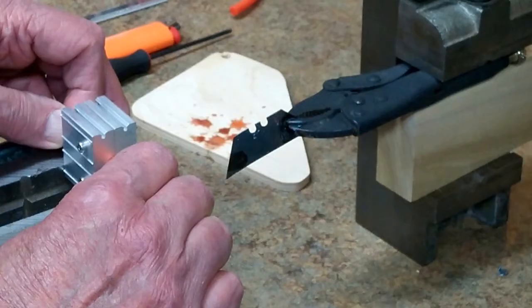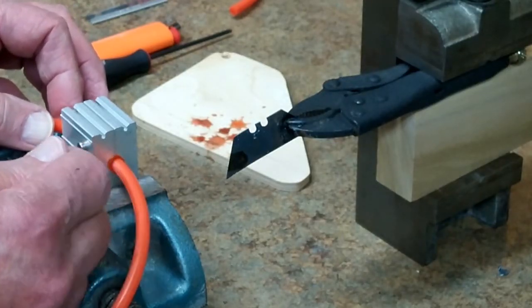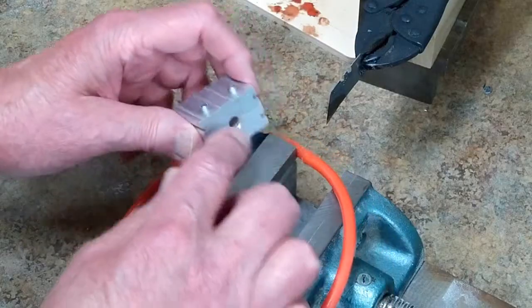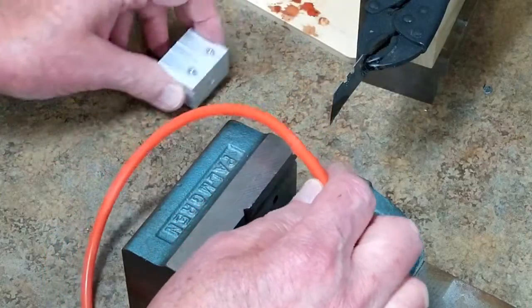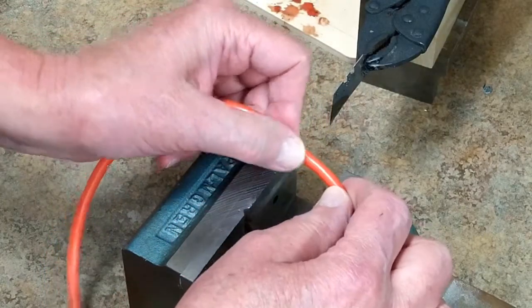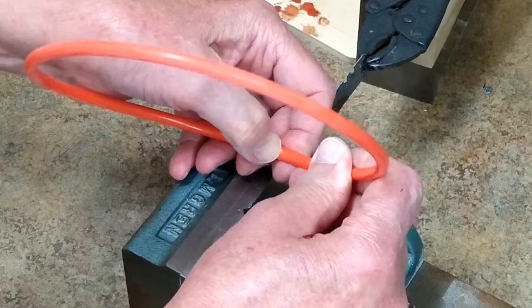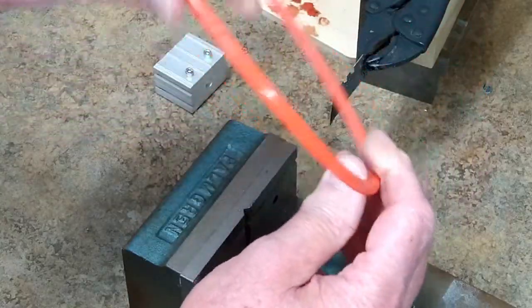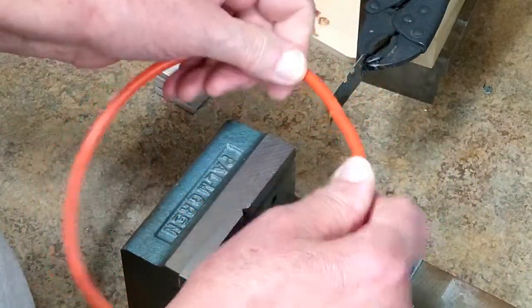I like to hold this for about one minute, putting pressure on both sides. Primarily I was pushing on this side and holding back with this a little bit to force that into the jig, and hold that together for about a minute. Then I'm going to let that cool off. I like the way the edge of the jig pushes that flashing away from the joint — it makes this real easy to clean up. And that's a good joint. The alignment's not too bad, and there aren't any holes in the edge. This is a rewind belt for the organ, and I tried that — it's on there, and it's a good strong joint.